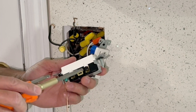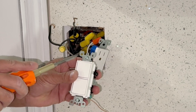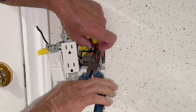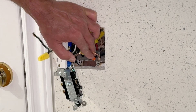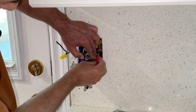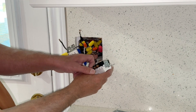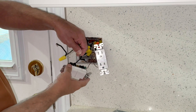Because we will be using only one of these two screws, it is better to tighten one of them. You can see 'Leviton' here — this side is up, this side is down. I will take care of the grounds first. This large wire nut can take up to four 14-2 wires; they are now connected to the ground coming from the circuit breaker. This is our power in — this goes to one of these two black screws.